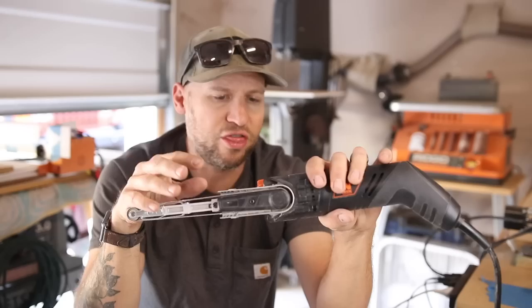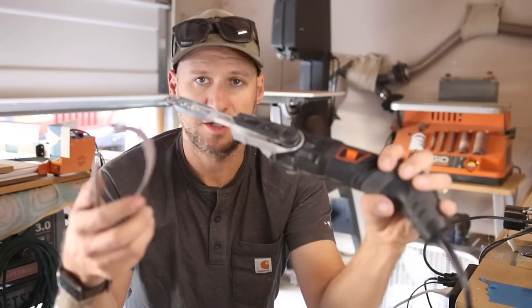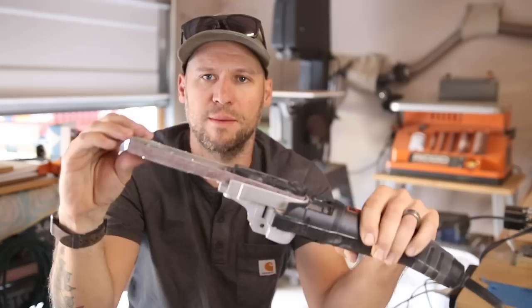The reason why I haven't is because changing out the sanding belts on this thing is so simple. I'm going to show you right now. So on here I have the 60-grit sanding belt that came with it. Here is the 120-grit. If I wanted to switch, you just push this in like that and it slides right off. So then you grab your new sanding belt. There's a little arrow that tells you the direction it's supposed to spin. You just hook it here around this pulley in the back and then around the pulley in the front. And then to tension it, there's a little button here on the back — click it. Bam. Auto-tensioning and auto-tracking. This thing will not fall off. No matter how hard I've pushed on it, the belt stays centered over the pulleys. Pretty incredible, honestly.